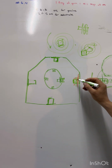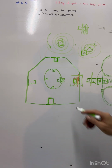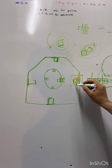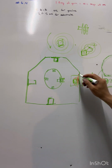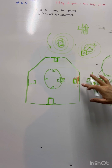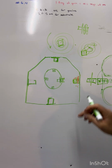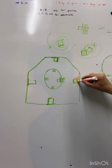Now you can get magnetic film that you could put over this, so you could spin the rotor, and as this pickup coil comes, it would energize this. You could literally see exactly what's happening in that core if you get a piece of magnetic film, and that would be best case scenario for you to calculate where your pickup coil over here should be.